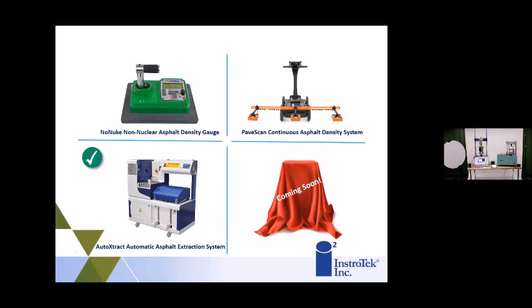Yeah, really quick. So GSSI, I know years ago we used one of their ground penetrating radars specifically for square yard projects where we had to have minimum depths. One of the issues was, and as you said, we see those charts in real time here. We'd have to process data for a very long time. Oftentimes it took far longer than it would take for us to be prepared to start the next lift, and it was effectively useless. So that's the real-time aspect of it. Is it straight up what you see in real time when you just download the data?